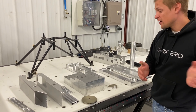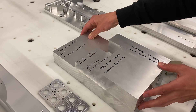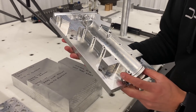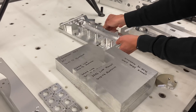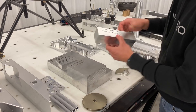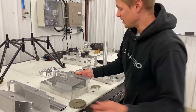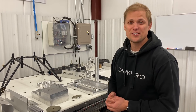We've got a lot more parts to come. This is the stock for the next parts we're going to machine. On the bottom is the raw stock for the aft trunnion half — you've seen the forward trunnion half Keegan's been working on, Op 1 complete, and we're going to flip it and machine the other side. We also have stock for a bunch of other parts: the little torque links, the drag link mount, and the upper drag link stock. This will interface with the two parts you saw in our last shop vlog. Lots of parts, lots going on, but it's all coming together and hopefully we get to test the gear pretty soon.